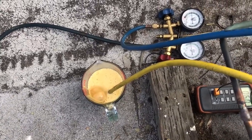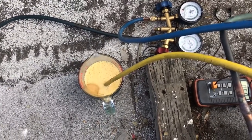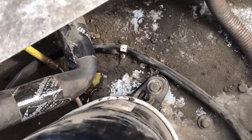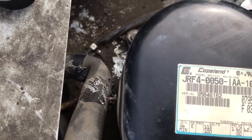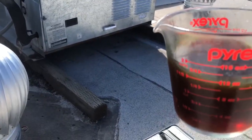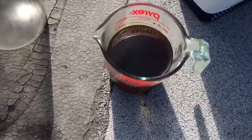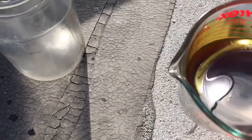This is the first time I've put one of these little valves on here. The compressor spec right here says it should be 16 ounces of mineral oil, although my little drain isn't completely on the bottom so I have to account for that. We pulled out about 12 ounces — that's what we're going to put back in.